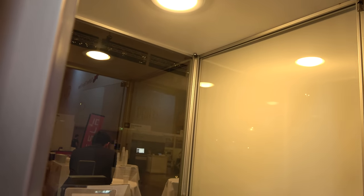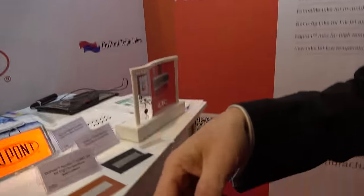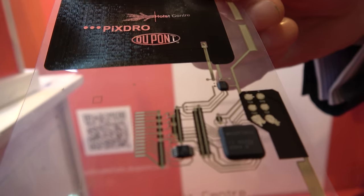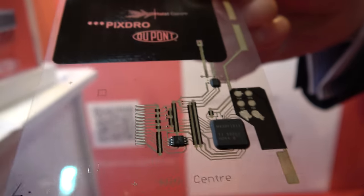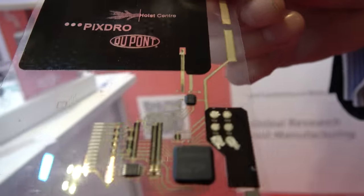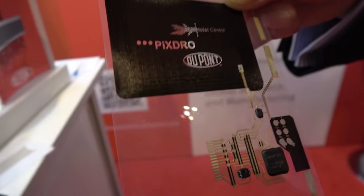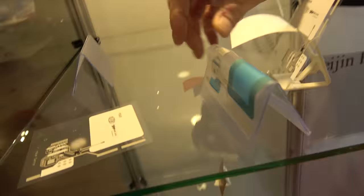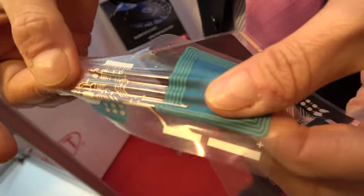This is a good example of what's possible — an NFC sensor unit with an NFC antenna and NFC chip integrated into a sensor circuit. There's a range of different materials: you can have an inkjet one, a screen-printed one, low-temperature or high-temperature curing materials, and they all function well. In this showcase, one is done on a stretchable substrate — you can see it's bent around and you can stretch it and it still works.